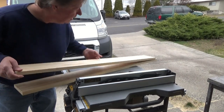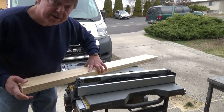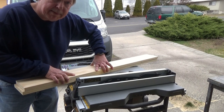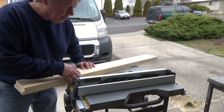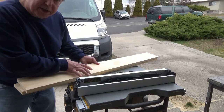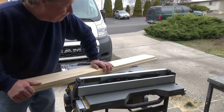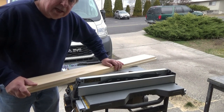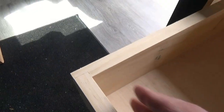I'm starting out with some 1x6 clear pine. As I found out with the first four drawers, although these are 1x6 — supposed to be about five and a half inches wide — some of these boards are a little wider than others. So the first thing we're going to do is true them up and make them all the same width, then cut the lengths for our drawers. Then I'll show you how we're going to make the rabbets and assemble this thing.